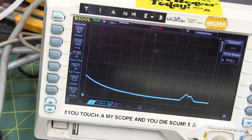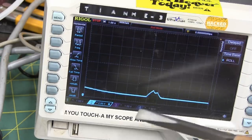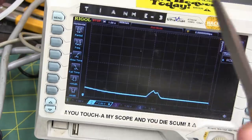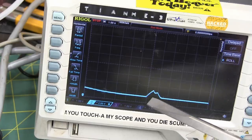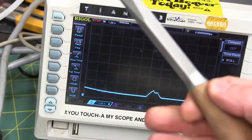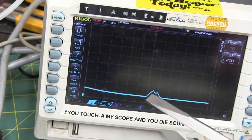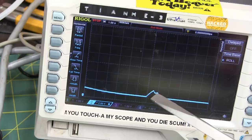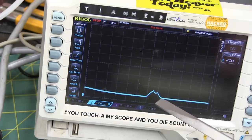And then frog smack! Now this is interesting. This is the pressure on the backside, on the blind end of the cylinder. Of course, it's throttled on the way out by that flow control valve. And we see it builds up. There's some stiction. Stiction is static friction. Diction is dynamic friction. So there's some stiction here, and then we get into the diction, and it moves, and then slowly drops off. So we're bleeding that off through that valve.